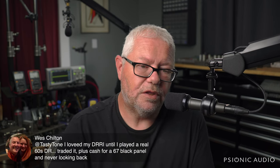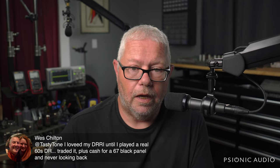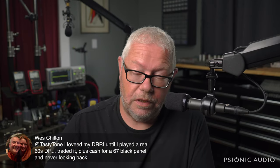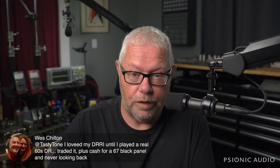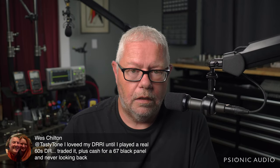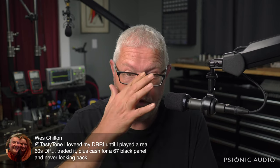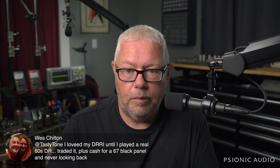Well, here's an interesting thing for you. Tomorrow, I believe, I'm going to be able to do those Joe Restivo clips that you've heard throughout this broadcast. I've got a 66 Deluxe Reverb here, a 65 Deluxe Reverb here, and two 68 Customs that I've made into real boys. And you're going to get to hear the same part played through the same amps, through the same speaker. The only difference will be tubes, though they're all biased about the same, about 55% idle dissipation. So people can make informed decisions.